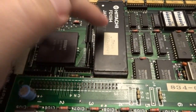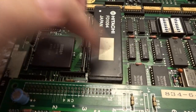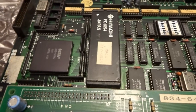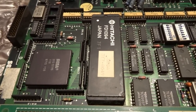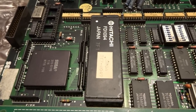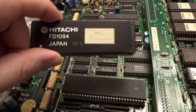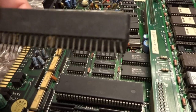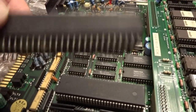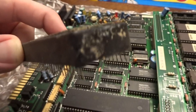Next we turn our attention to the Hitachi processor. This has about a million pins so I want to be extra careful getting it out, and also avoid getting any battery acid on my fingers since I can see it leaked out on the surface. I used the flathead screwdriver, which was more effective due to the number of legs. It pried out nicely. A couple of legs did bend slightly during removal, but I didn't break any in the board — that's the most important part. Once I started prying it up, there was even more battery acid visible on the outside under the cover.